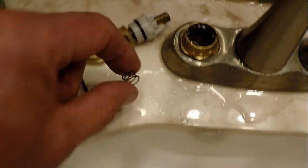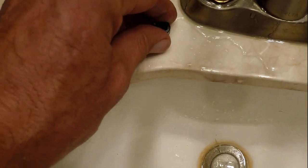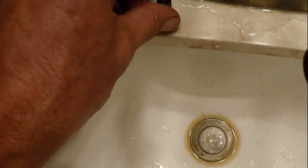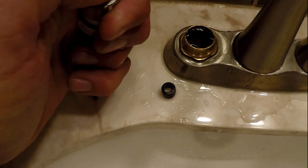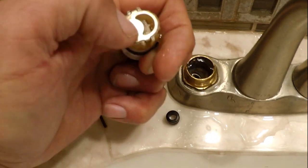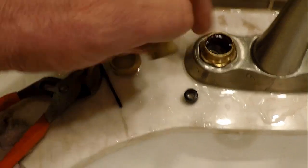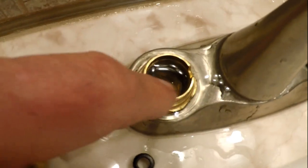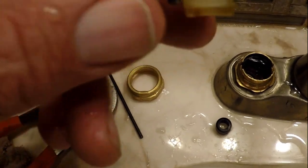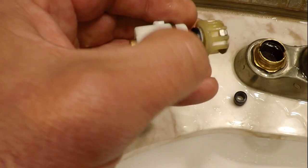Down in the hole, I was able to grab both of them. You've got a tapered spring - the smaller section goes up. You have the seal on the bottom that actually seals, shuts the water on and off, and that rides right here. This is the closed position when it's completely blocked, and then your open position. There's an o-ring that seals to the outer part, and a seal on the inside. I'm guessing, just by the way it was coming out, that this inner seal right here is what the issue is.